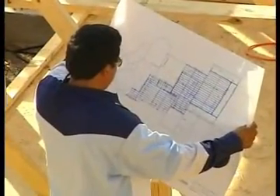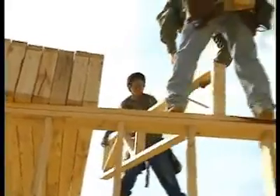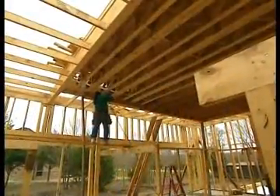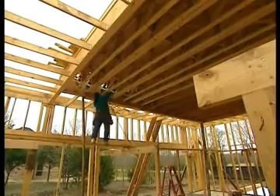A layout plan tells the crew exactly where and at what spacing each truss needs to be positioned. Because these trusses do not depend on any partitions or interior supports, the spaces beneath them can be as wide open as the homeowner wishes. Nowadays, the clear spans are getting longer and longer because the use of better materials, and Southern Yellow Pine is one of them.